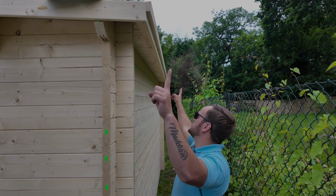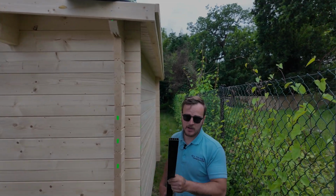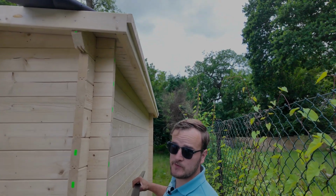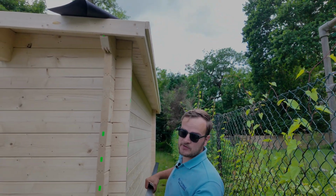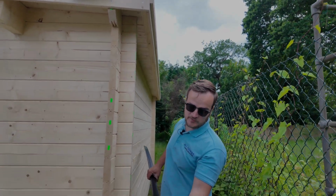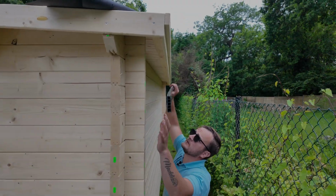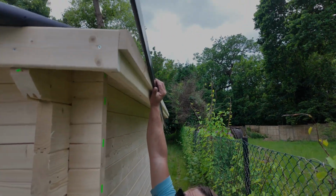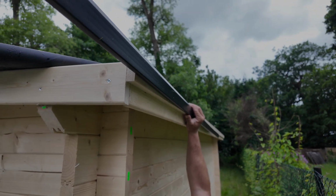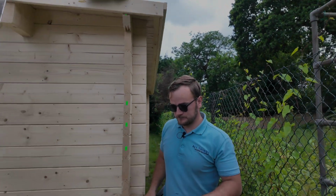After you've got this made up, the first thing you're going to want to put on there is the first part of your 2-part gutter trim, which looks a little bit like that, and it's the smaller one of the two. And the reason I say about using 50mm timber up here is it's pretty much the same as this. So what happens is this goes up here first and it gets nailed on. You don't go too crazy with your nails because you are going to nail through it again, which I'll show you now.